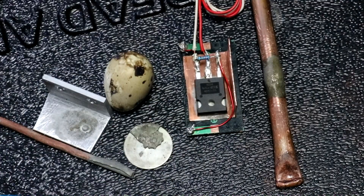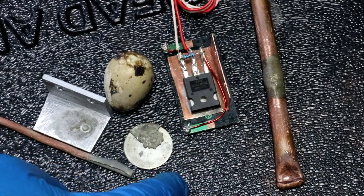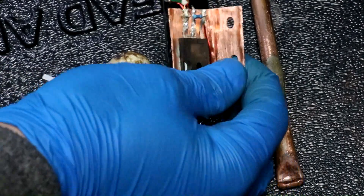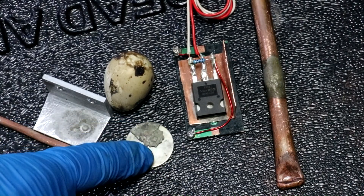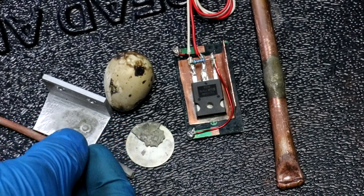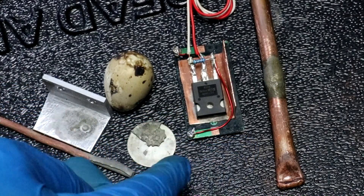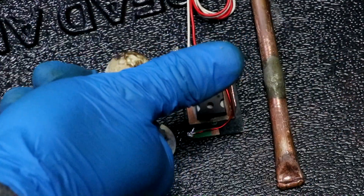So there you have it. Of all the tests over the last couple of days, the only really successful application was using the amalgam as a heat sink compound — although commercially available thermal paste with a bolt would probably be just as good. In the future I'd like to try a different mixture: instead of just copper and mercury, maybe a silver-tin-zinc mercury amalgam like the kind used in dental fillings, which is presumably a lot stronger. Until then, I hope you enjoyed and I'll see you next time.